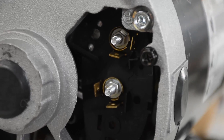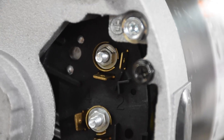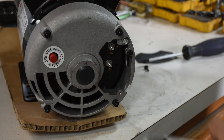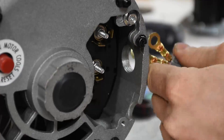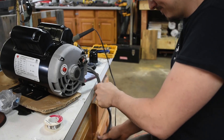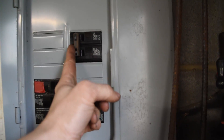On the inside, we have these two terminals — one, five, two, four. I'm sure there's a three in there somewhere. The numbers on the label should tell me what I'm connecting. A simple dryer replacement cord. So this is a 220-volt single-phase AC motor, and that means what I'm wiring in here is two hots from a 220-volt line and the ground. And I've got to make a socket so I can actually plug this in.